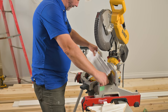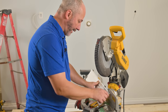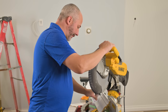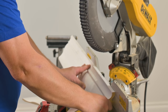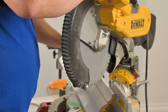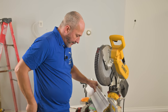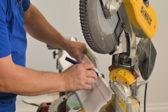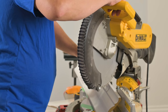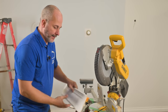This is measure once, cut twice — my system, especially for DIYers. Until you get to know your tool really well, or unless you buy one that has a laser, you don't exactly know where that's going to cut. So come down with your saw blade, make a mark on your material, and then slide it over relatively the same amount. When you're just a little bit shy, do a first cut. That'll show you where it cuts on the back relative to where the material is. Now I only have to move over an eighth of an inch — that's perfect.